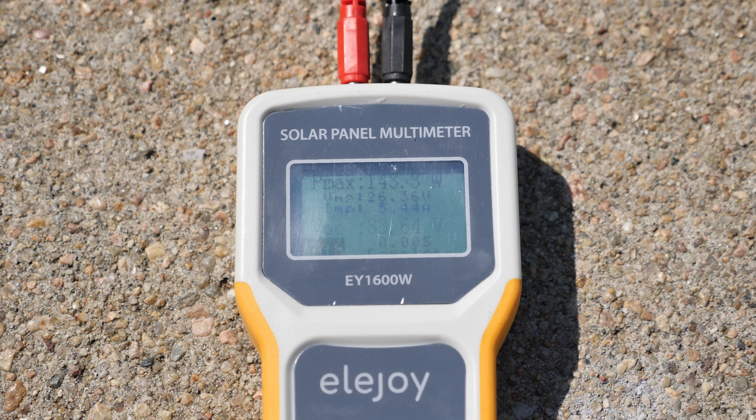That's going to conclude the test. It does look like adding white reflective material underneath bifacial panels gives about a 10% average gain from having the cardboard removed from the back side. The shattered panel showed more like a 17% gain, which was a pretty big difference — assuming my math is correct, which you can correct me on in the comments.